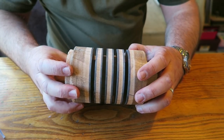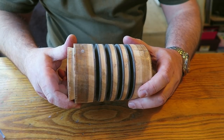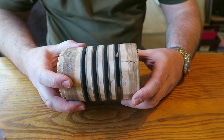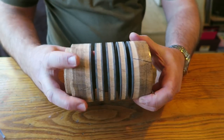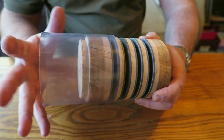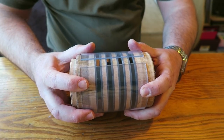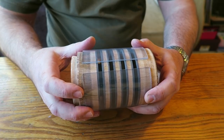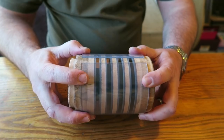I've cleaned it thoroughly and made sure there's no dust or anything — it's very difficult getting rid of the black dust. I used a compressed air gun and wiped it down with some acetone as well. Now I'm going to put the housing on; I've cut a slot in it to facilitate pouring the resin and to help get it off when it's finished. I'm going to put some cable ties around and seal it up with hot glue.